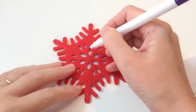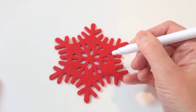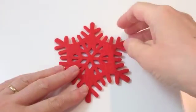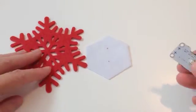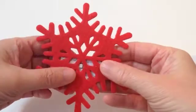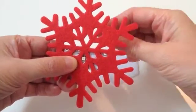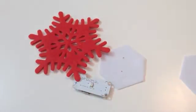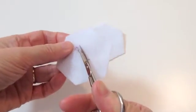I'm using a specialist marker pen - just put a little dot in the center - and this pen disappears within 48 hours, so if I make a mistake on the fabric it won't be there forever. You'll need to plan where you're going to put your LED and your cell holder. I need to work within the restrictions of those two spaces, working out where the light sensor is going to come through, where the LED is going to come through, and whether there's space for the two to sit together. This project takes a little bit of planning as to how your circuit will be laid out.